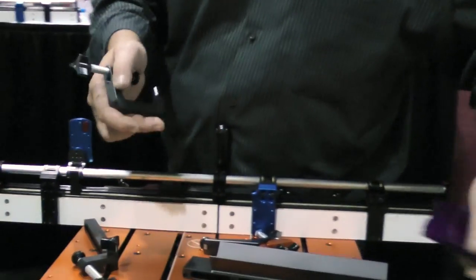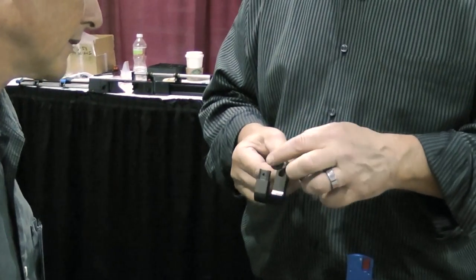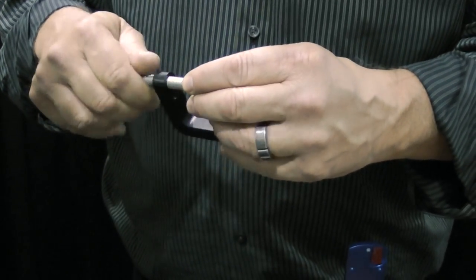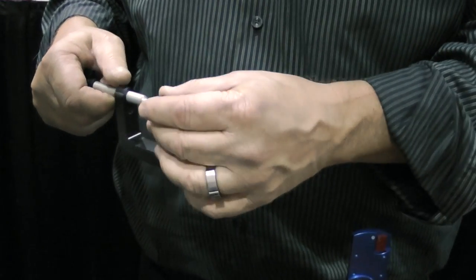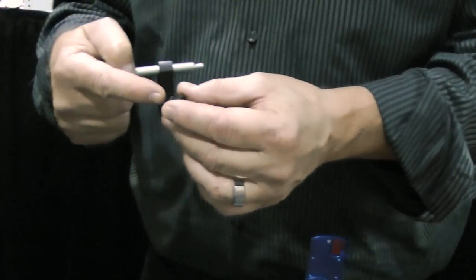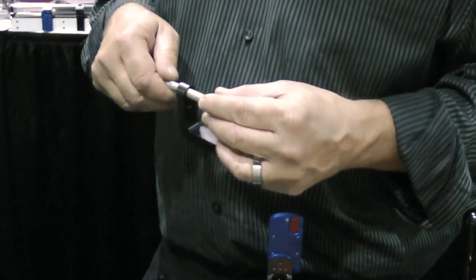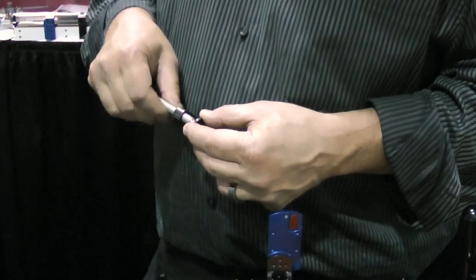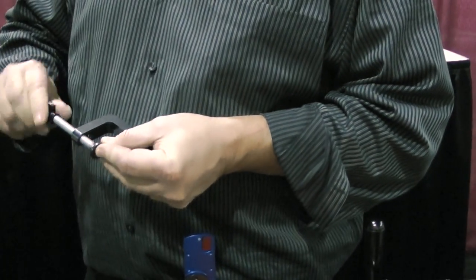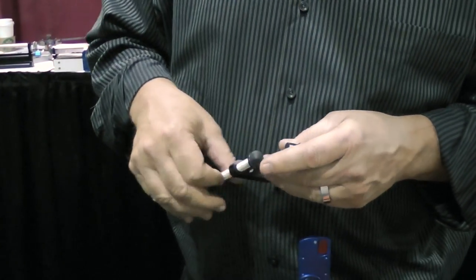Check this out. Our swivel system, we didn't invent this. I don't know who did, but it's genius. See that swivel? Yep. Watch this. It's reverse threaded. Uh-huh, cool. So it's back cut. There's only one thread in there. You don't need the thread for anything. It doesn't do anything except act as a retaining ring. So it's a reverse thread because most of the time you're clamping. Right. And then it just spins. And also when it's clamping, that's when it would stop it from spinning and it would unthread. Exactly. Very nice. Well, I can see it being stuck to a piece of wood.